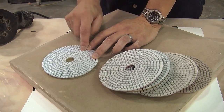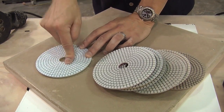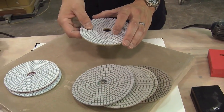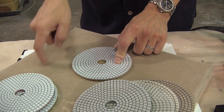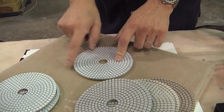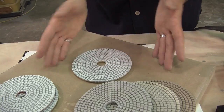Lots of diamonds. All the diamonds are very high quality grade, and they're all the same size, which is important. In this case, I'm going to take a 200 grit pad — fairly fine diamond. I don't want any kind of 50 grit diamonds in there, because it's going to leave scratches. On really low quality pads, the diamond gradation, the sizes of the diamond particles that are in there, is quite broad.